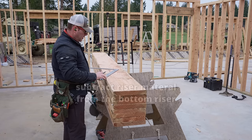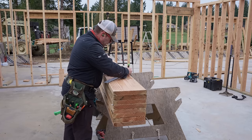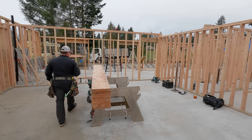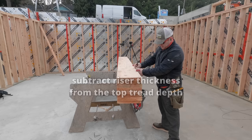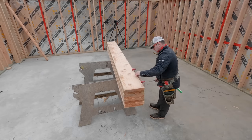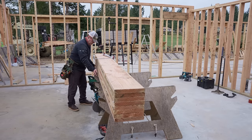Just find that the heel always has to be slightly cut. I'll just do it now. Okay, so a riser. I'm going to cut this line, all the way up. I'm going to cut this line and this line. Now this move is necessary because as I go, since I'm right-handed, I want to make sure that my saw is square.